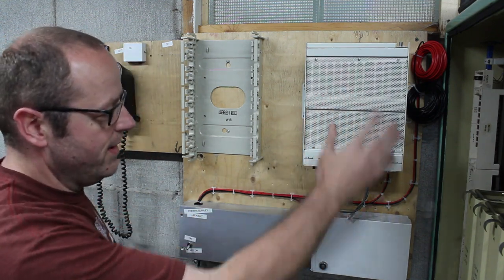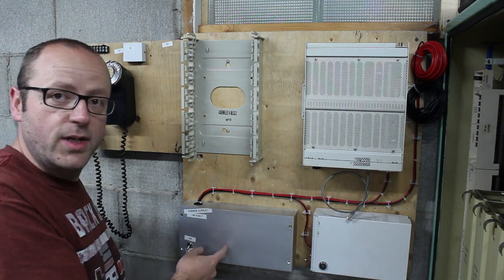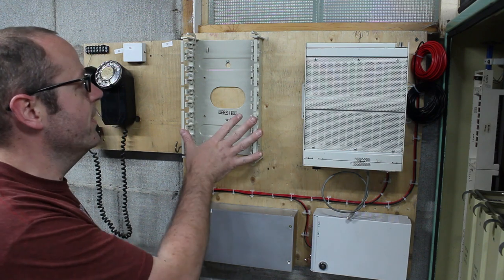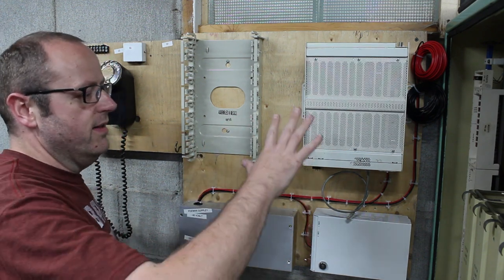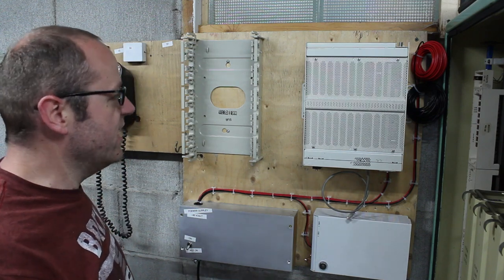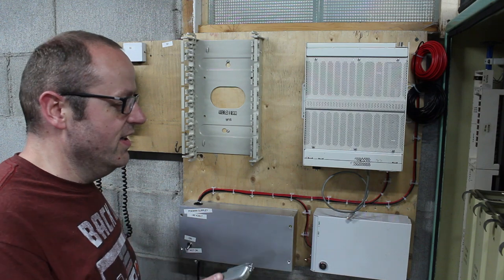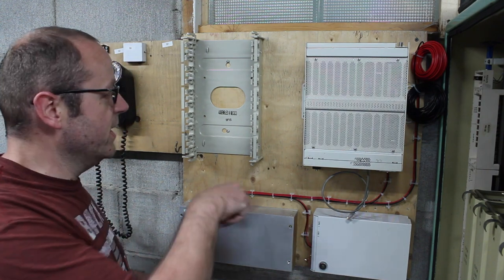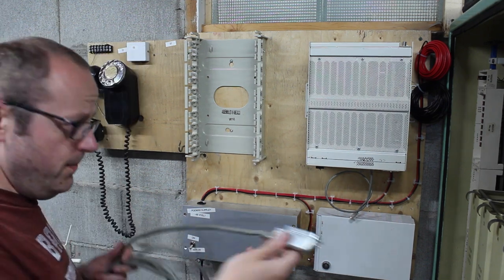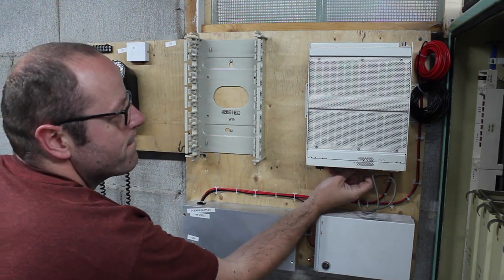Anyway, I've got the channel bank mounted. I've got my HDSL stuff. Power supply, I built a nice little box for and shoved that in there. And I've got my Bix block mounted here. And this is kind of all I need for my capacity. So today, I'm going to do a little bit of a demonstration on doing a Bix termination and that kind of thing. So the cable plugs in to the bottom of the channel bank here.